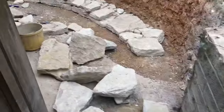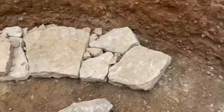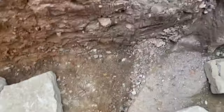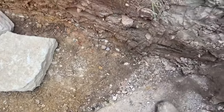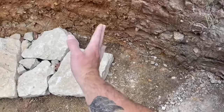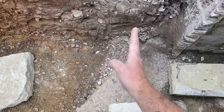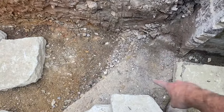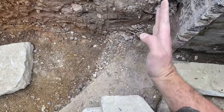Here, I believe the wall is ending at that angle, hence why that stone's there, because it's gonna mirror this angle. So we're gonna clad onto the end of here about 150, 200, so it'd be about here, the end of the wall, and the wall would be about there. Then in this gap we're going to build an end, literally on that angle, mirroring it, so the angle's the same, because this cladded wall is going to come out to here.